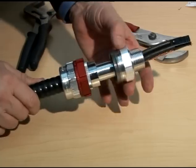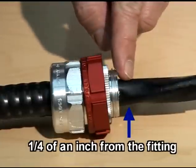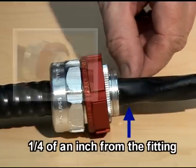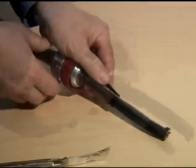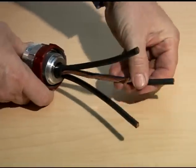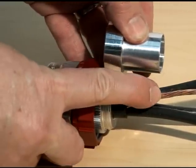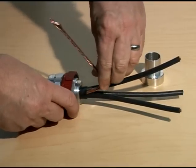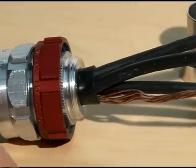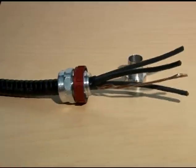Always verify if the bushing is tightly compressed and extrudes evenly with the gland and collar ring. Unscrew the red coupling nut and remove the body from the hub. Unscrew the sealing chamber. You now have to shorten the inner jacket, keeping approximately a quarter of an inch — roughly the width of one finger — from the end of the fitting's threaded body. Carefully cut and remove the remainder of the inner jacket to expose the conductors. Separate the conductors in order to expose the ground wire. Place the sealing chamber next to the conductors and determine the position of its top opening when it is finally installed. From this point, bend the grounding wire 90 degrees and rotate it a quarter turn on itself in order to untwist or birdcage the strands underneath the fold while leaving them twisted on top. Straighten the ground wire back in place.